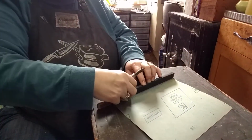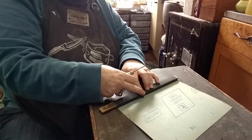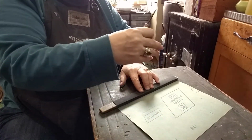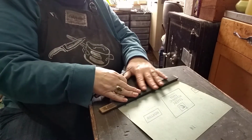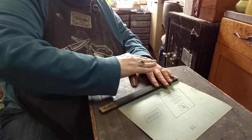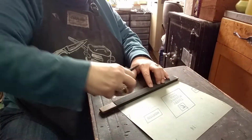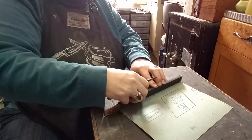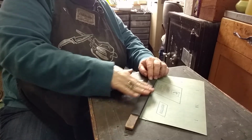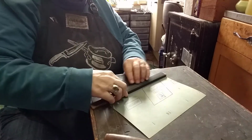And what this also helps to do, besides just creating corners that are going to fit into angles well and do the emery work that they need to do, it also has flatter surfaces. If you were just to wrap this, each face of this would kind of dome a little bit. This way, because you're scoring it, it lays flatter. So it's a truer surface. And that's handy if you want to do the edge of a bezel or something. You can just rub it right along there, and it's not going to be dish-shaped underneath because this is pretty much flat. So I keep on going.